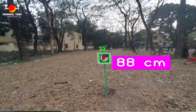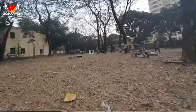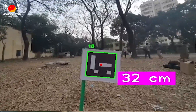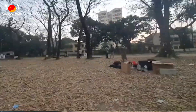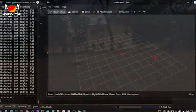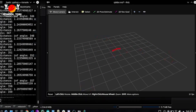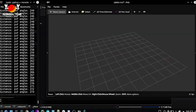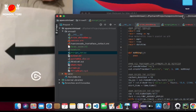We use LiDAR data for obstacle avoidance and mapping the surrounding environment, and NVIDIA Jetson for processing data. For distance estimation of AR tags, we are using OpenCV. We have calibrated the camera by placing the tags at different distances from the camera and noted the measurements after calculating the distances between the starting and ending points. Later, plotting the results on the y-axis and the distances on the x-axis in a spreadsheet, we got our desired equation, which resembles a third-degree polynomial equation. Afterwards, we used the equation in our code to find out the desired distance.